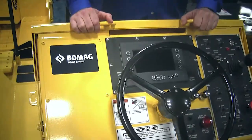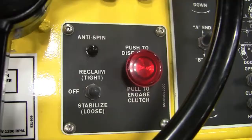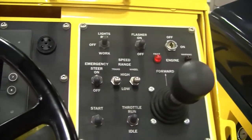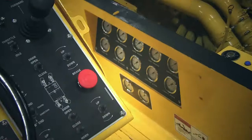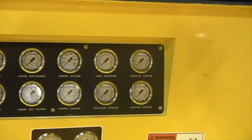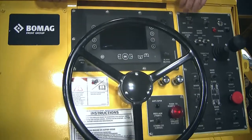It uses a Sauer's control system. One of the nice features, besides automatic cut depth control as well as load control, is that you can do calibration for elevation as well as steering without the use of a laptop — it can all be done directly from the display. For reliability and information, we have manual dial gauges in addition to the normal control display, covering everything from the cooling fan systems, the propel, case pressure, and additive systems. You have both water and emulsion systems that can be used as an option, and the control system is already programmed so this can be a field-retrofittable option.